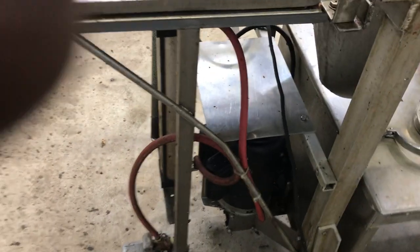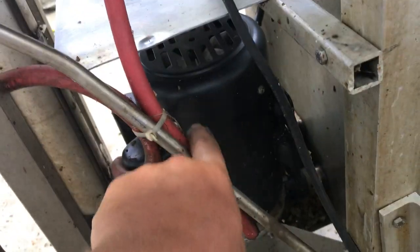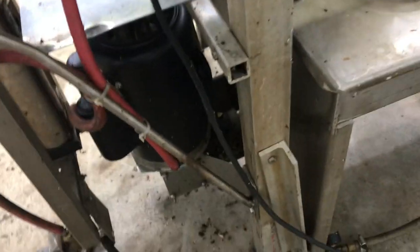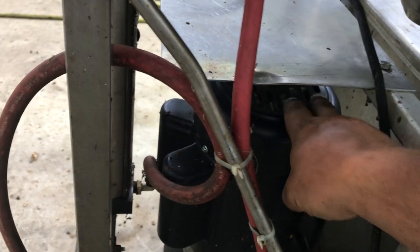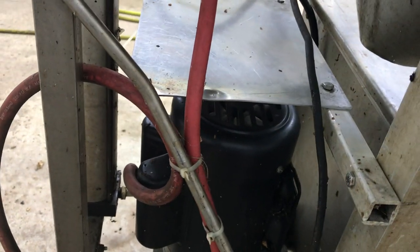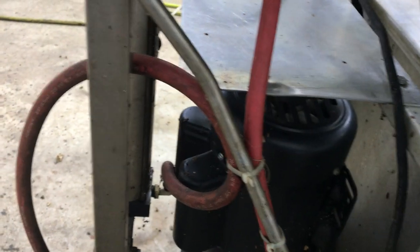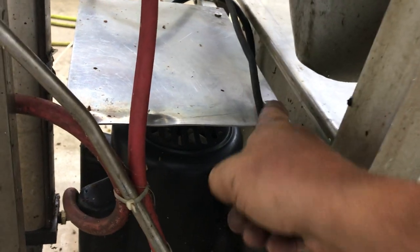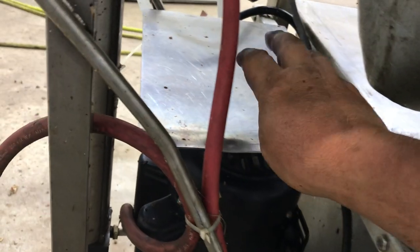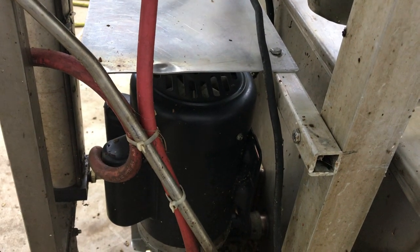One more: I installed this little plate here on the motor for the auger — pretty standard design for Cowan. I always found I had lots of wax and debris getting into the vents of the motor, so just this little plate: a bar across, bolted on here, with a stainless plate bolted above. All the debris is caught by that and it doesn't get into the motor, and it doesn't appear to affect the cooling at all.